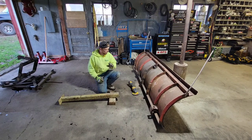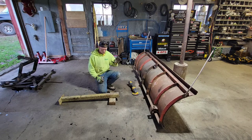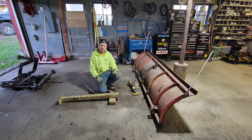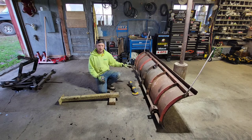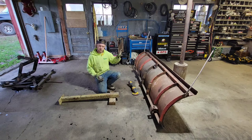We've got everything cleaned off the back of the plow blade — this is all we're using. The next step is we've got to cut out 10-inch-long pieces of this square tubing to weld to the back of the plow blade, essentially to make a pocket to slide the cutting edge of the skid steer bucket into, so that way it stays on the bucket. You can also control the pitch of your plow blade by rolling your bucket back and forth.